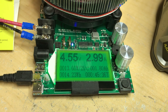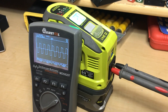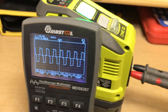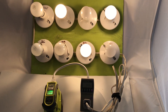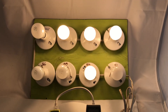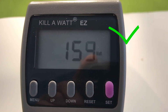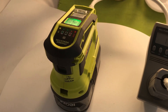The USB Type-A port specs 5 volts at 3 amps. Unfortunately it's still a modified sine wave output — it would be really nice if it were pure sine wave, but it's not. I've got my light board set up and I'm currently drawing about 145 watts. I turned on one more bulb and it's just over 150 watts, so it's meeting the spec of 150 watts. The fan has now come on.